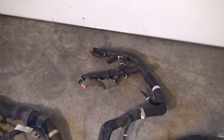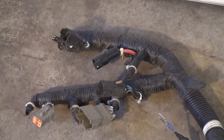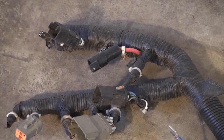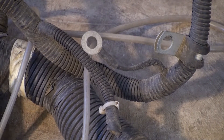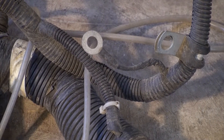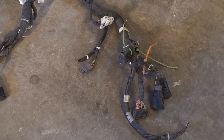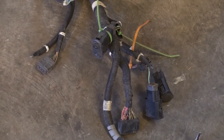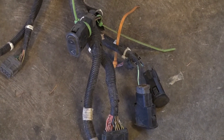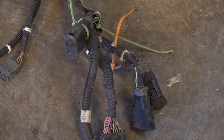Follow the harness back and you run into a leg dropping off. There is a single thick red wire that logically might be the power supply. You will also see a black wire with a ring terminal that is probably a ground wire for the cab. Follow the wires further back and you can find a switch connected to a harness. There are other connections with blanks — it might be for switches that were not installed in this machine. One could assume this part of the harness will go to a console on the other side of the seat or up into the overhead in the cab.